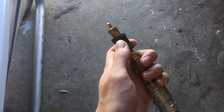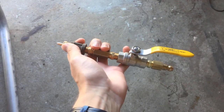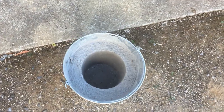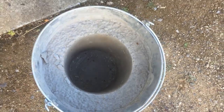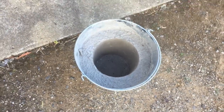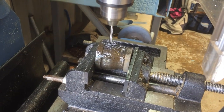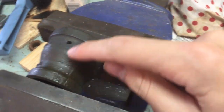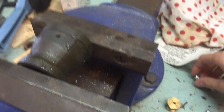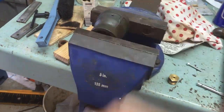It's the next day — those pieces are finished de-galvanizing. This piece will screw on here, and we've got the little nozzle that we made, so the actual gas part of the torch is done. We've got the valve — gas will come in here and exit out that little tube. The cement of the furnace feels pretty dry but the instructions say to leave it 48 hours, so we'll leave it another day or two. We've also got to drill a hole to put the torch in. We drilled four holes each 90 degrees around this piece — we'll tap the holes and that will hold the gas nozzle, which will be our entry tube to the big gas torch tube.